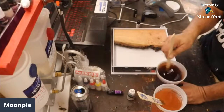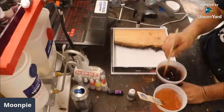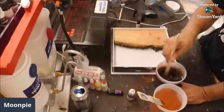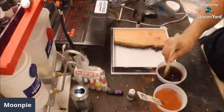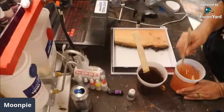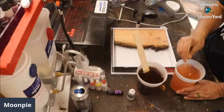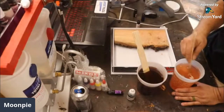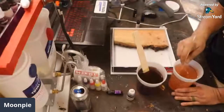Somebody asked: how important is dry wood in the resin process, and do you test for moisture content? I do test for moisture content — it's best to have your wood under 11%. Some resins are more forgiving of moisture than others. Slow set I've found to be more forgiving than two-to-one. Alumilite is not forgiving of moisture at all — it has to be very dry for alumilite. Kevin probably could answer that better, he uses alumilite. I've only used it a few times and had issues.